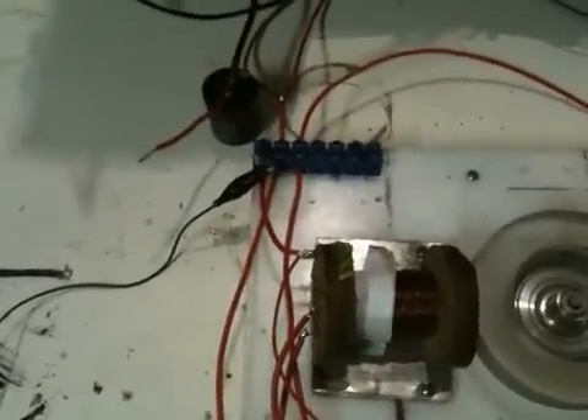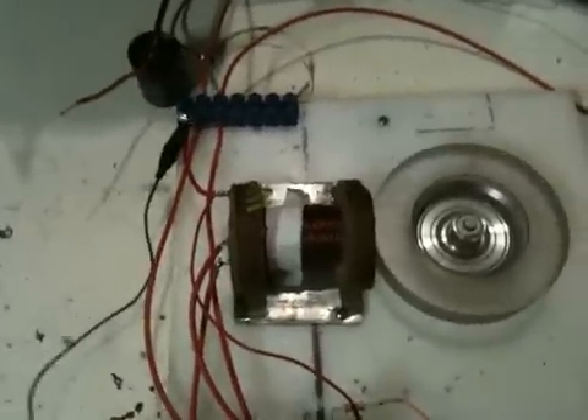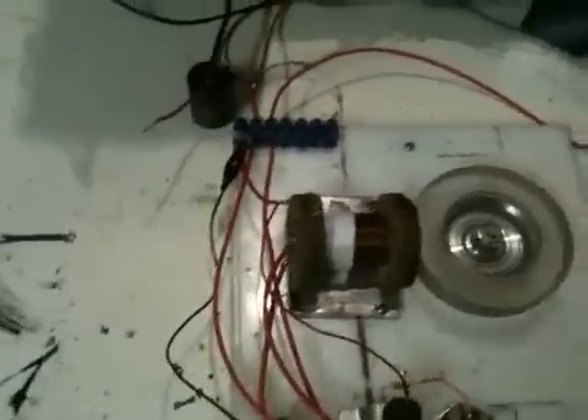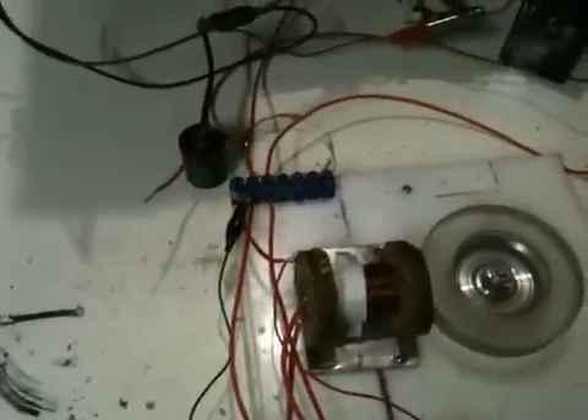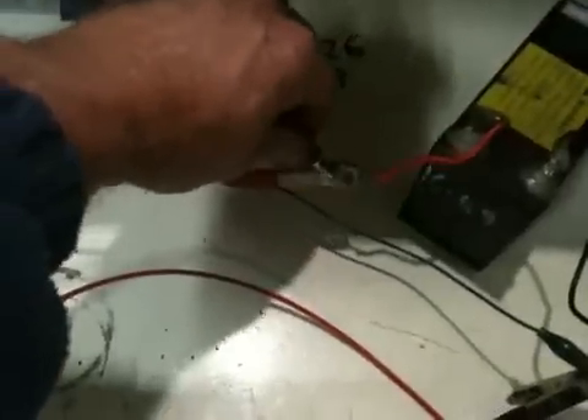The neon — I could only find an 80-volt one, I don't have a 110-volt. So I actually have to disconnect it once the cap reaches near 80-90 volts because it just lights up. We'll hook that up for you so you can see it anyway.